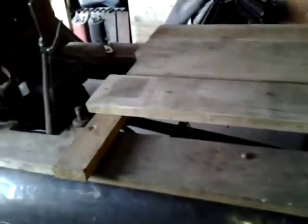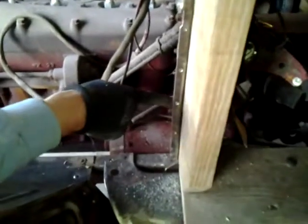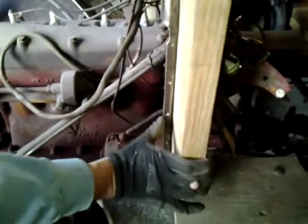It's 40 inches wide at the base, about 36 at the top. We used wider wood than you'd normally do because we wanted extra on each side since we're not using oak — we just wanted to beef everything up a little bit more. You have to cut out up here where a brace comes through, and we just took the saw and cut a line in there, then used a roto-zip to grind down where the bolt heads come through so it'll sit flush.